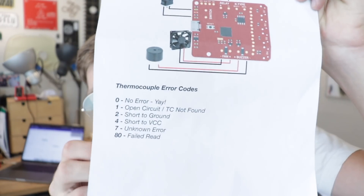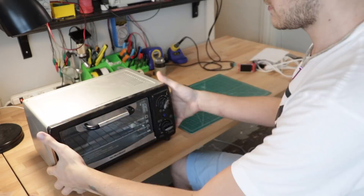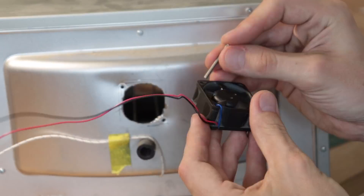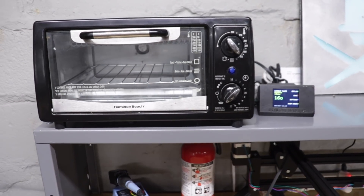His kit was super easy to put together. I just set my toaster oven to on and high, then use a solid state relay to turn it on and off — that's how the Reflow Master controls temperature. I already had an extension cable with a solid state relay, so I just wired the toaster oven up to that and connected the appropriate pins from the Reflow Master board. Then I mounted the thermocouple inside the toaster oven and cut a hole for a fan. The fan lets the Reflow Master bring in cool air and cool down the board at the rate recommended by the solder paste profile — so I don't have to worry about opening the door right when it beeps. I printed Sion's case design, got all the cable management squared away, and now I've got a little toaster oven reflow setup. Best part: it actually fits both sized panels with no problem.